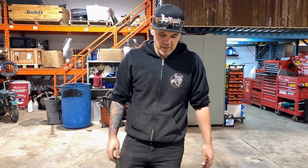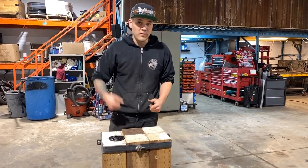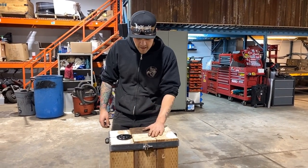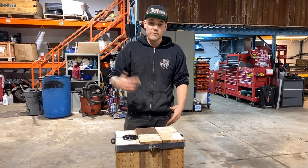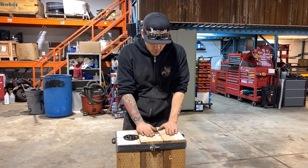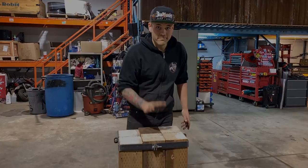Those are just ideas. But for now, we're just gonna make the bowl just for tuck shrinking, something that we can use the mother tucker hammer on and show you how much better a stump works than a sandbag for that type of shrinking. So I hope that this thing's gonna hold up. I'm gonna draw myself a circle here and get to grinding.